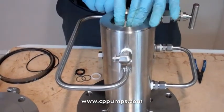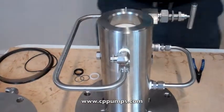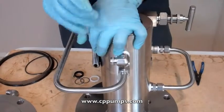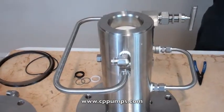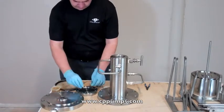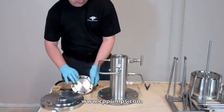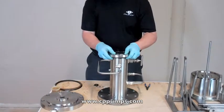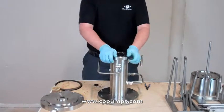It should also allow your spool to easily slide. Tighten this down at this point. Using a little grease, we're going to insert our final housing o-ring. Just like on the flange, there's an alignment pin here and one on the top cover.